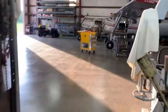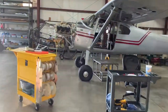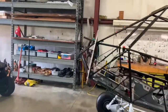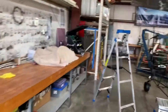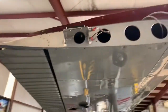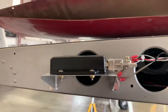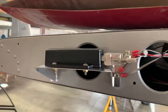The harness has been put in the plane. First thing we did was mount the GMU 11 on the wingtip — I'm going to show that since I had a request in the comments. We mount the GMU 11 out on the wingtip with a bracket that we fabbed up. It's just a simple bracket and you want to get it level with the top of the door seal, since that's the level point on this plane.